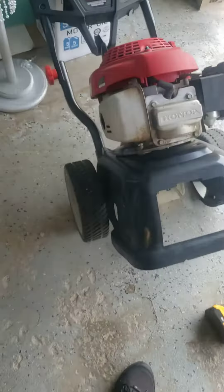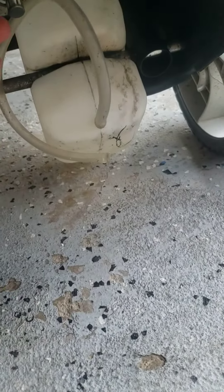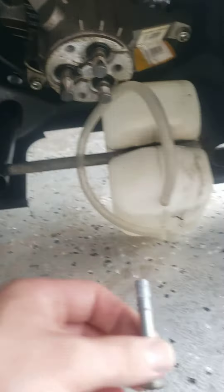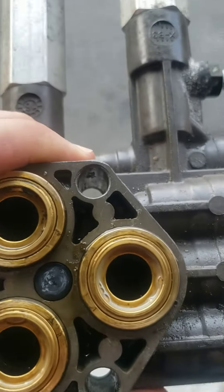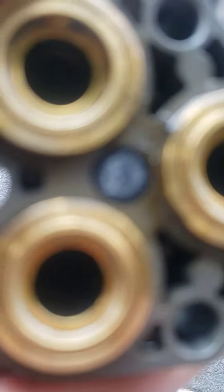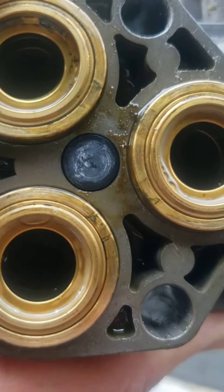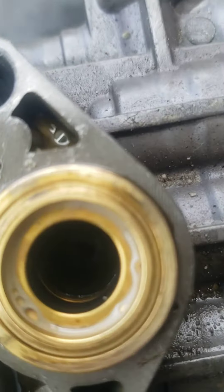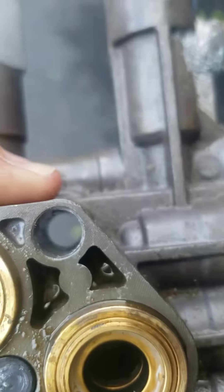I just took the three bolts off the head here. There's my head, and there's the three bolts — I basically unbolted the head. That'll take your head off. And there's these little check valves in here; there's three in each one of these — one, two, three. They're way down in there, kind of hard to focus. Either way, those check valves are fine. There's little springs in them.